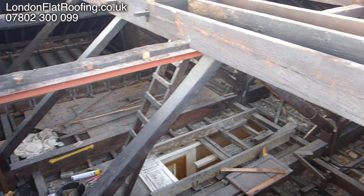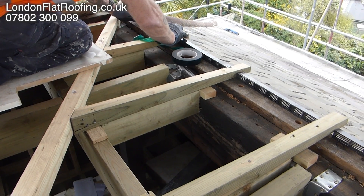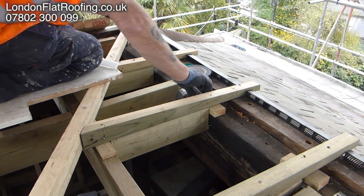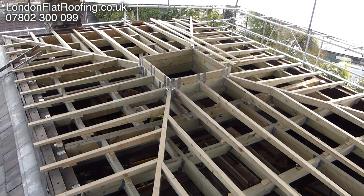We're looking down into the area which will be the loft conversion. Going around the outside, we've already put all the new joists in — all treated timber — and all new furrings have already been put in. We're just going around the perimeter now putting in a vent, because this is going to be a cold roof.